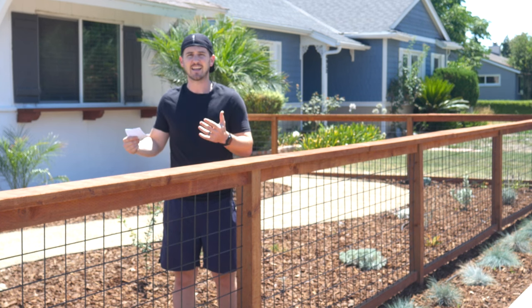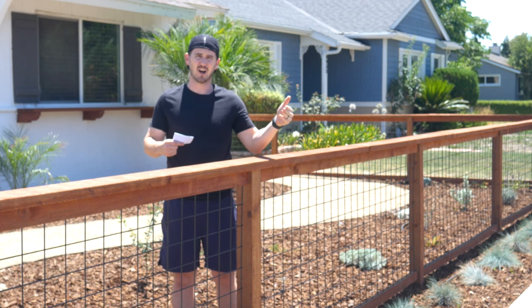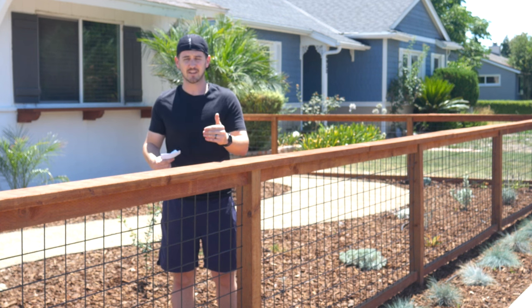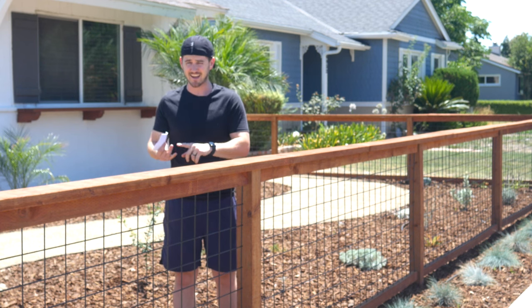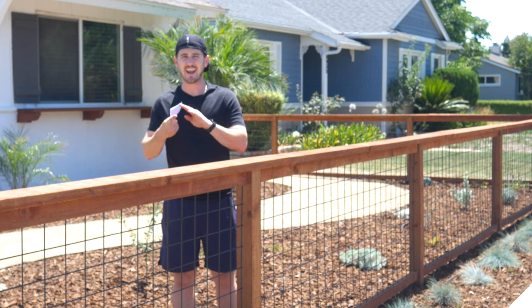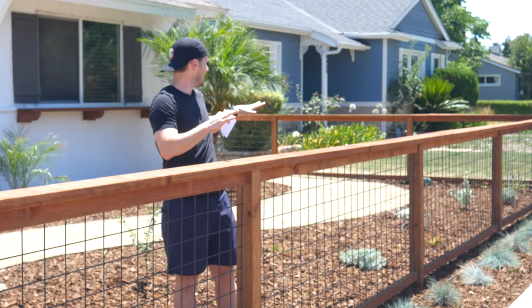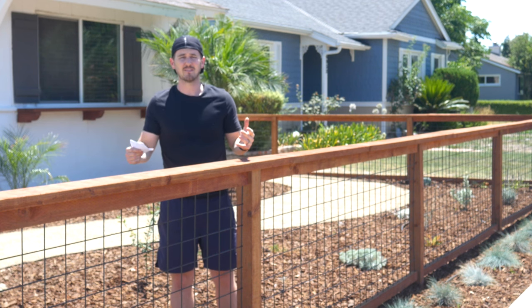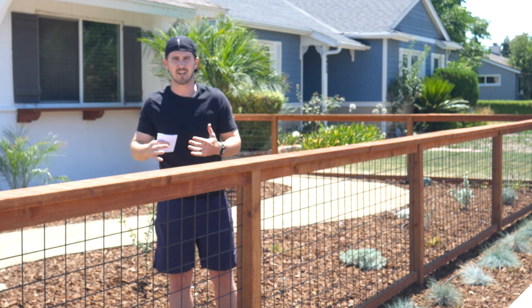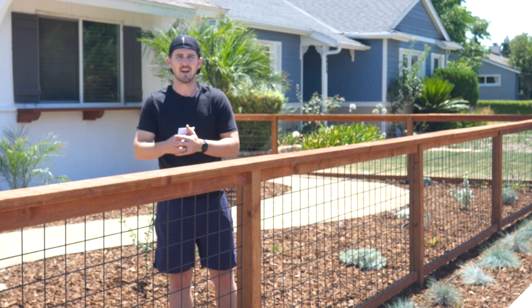The last and probably most important thing I did in prepping was - at least in southern California - calling the dig alert line or going to digalert.com, which I'll link in the description. They offer a free service because you're going to be drilling pretty deep into your front lawn and you want to make sure you're not drilling into any gas lines, water lines, sewer lines, or cable lines. They come out and mark on your street and driveway where all those things are and give you the go-ahead that your build won't interfere with them. If you break this project into steps and do your prep ahead of time, it's very manageable.